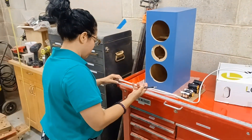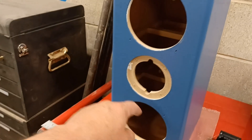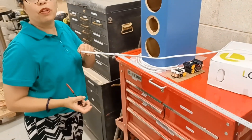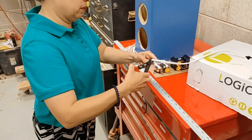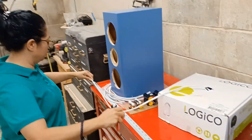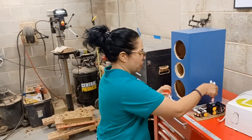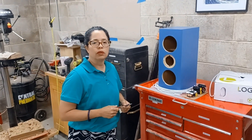We also need a line to connect the top woofer down to the crossover — probably two or three inches longer, so about 24 inches. As for wire type, you can use whatever kind you want for this; it should be basically 16 gauge. This happens to be 14 gauge in-wall wire, but it doesn't have to be that thick — the lower the gauge number, the thicker the wire. So we've got two of those wires cut. Now we just need to strip the ends and get them ready to solder to the board.